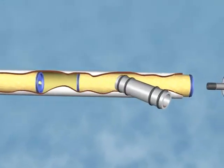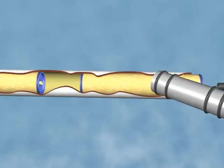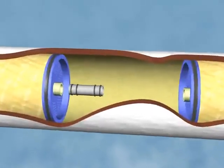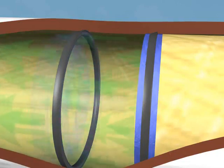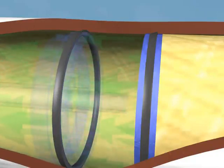These O-rings on the couplers are used to prevent higher pressure feed water from passing into the product tube, thus contaminating the product water. Each element has a brine seal placed in the groove located on the outside of the anti-telescoping cap. It is critical that this brine seal always be placed on the feed water inlet side of the element and that the seal open in the direction of the feed water. This seal prevents feed water from going around the element rather than through it.